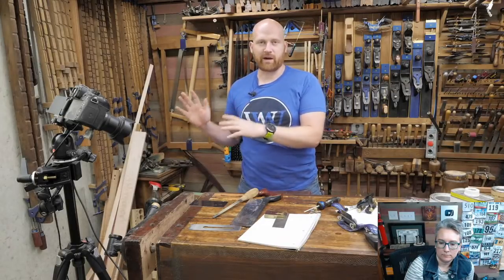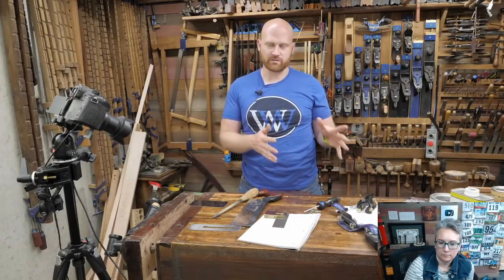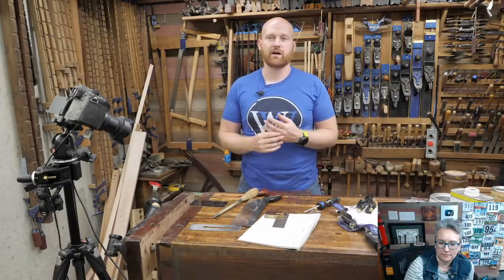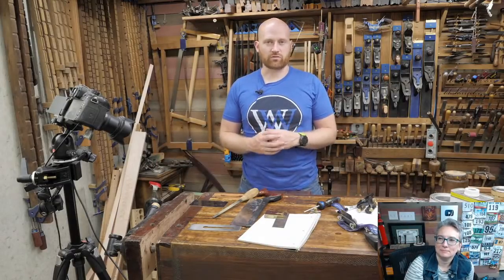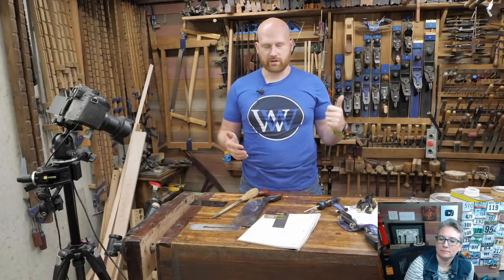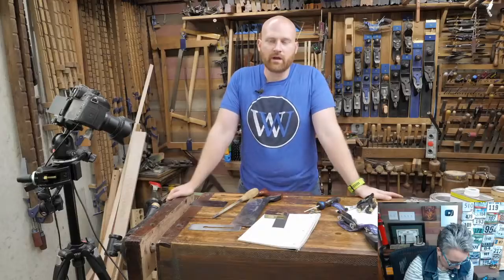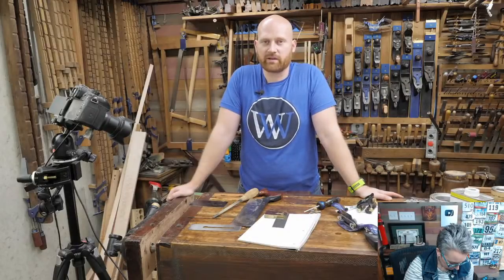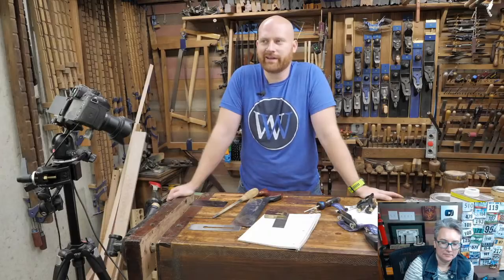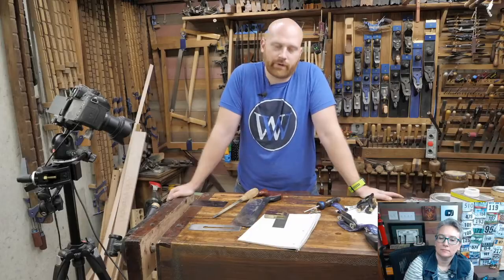When I was making a fiberglass airplane, I used that because it is a known substance. There are crazy amounts of tests that have been done on West System epoxy. It is known structural. Then there is Total Boat High Performance, and that's what I use now. It's a little more cost effective, though you're still going to put down $100 on a gallon. But most people consider that an investment because for the average person, a gallon kit will last you a decade or more. I was talking to one person who's been working on the same batch of epoxy for 12 years. So yeah, it lasts pretty well.